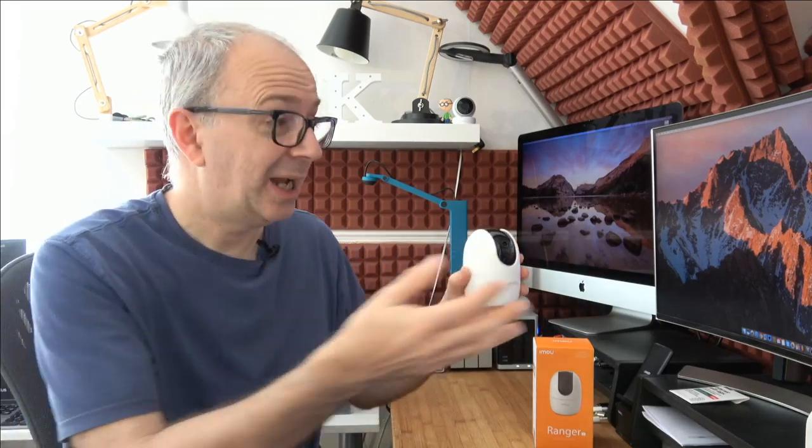Something people often mention is: what if your internet or power goes down — then these cameras are useless. There is a solution: I use little UPS devices, like bigger power banks with 3-pin UK sockets or IEC connectors. I use one for my computer too, giving me about 20 to 30 minutes to shut down properly. All my security cameras are plugged into UPS devices, as is my internet, so if mains power goes down I've got roughly an hour to an hour and a half of internet and camera power. Invest in a UPS if you're worried about your cameras needing power all the time.